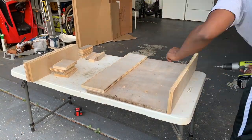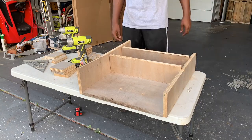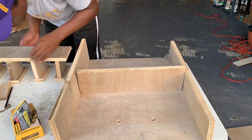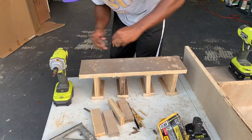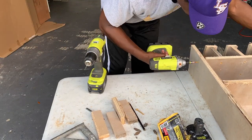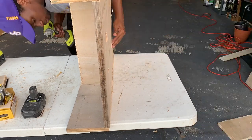I went ahead and pre-drilled the sides. Make sure you pre-drill the holes because you don't want your wood to split while drilling in your screws. I did my sides first, then noticed I did one side longer than the other, but kept going. I went ahead and did the bottom T-pieces first because it would be easier than trying to drill them in after putting the shelf in. Then my battery died, so I had to switch batteries mid-drill — nothing demolished though. From there, I drilled all my T-pieces in, put my shelf in, and drilled it in from the side first — two screws on each side. Then I flipped it, drilled from the back with two screws for extra support, and ladies and gentlemen, we have a rack.